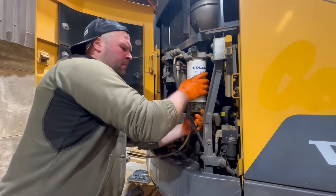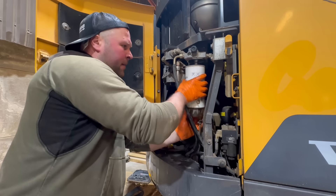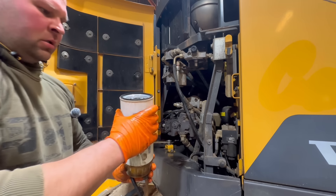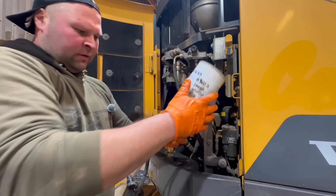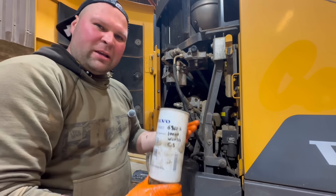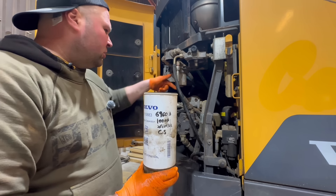This one's got a glass bowl on the bottom — they usually just want a bit of a clean out. There we go. Fuel filter — we're going to take this glass bowl off and put it on the new fuel filter. How easy was that? How long did that take? I've just got one hydraulic one just around here — that's it. Why can't all manufacturers do that?